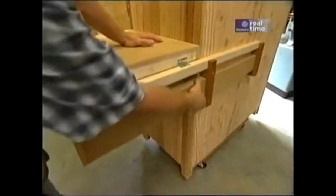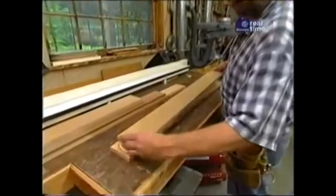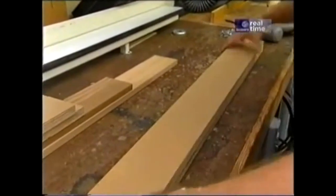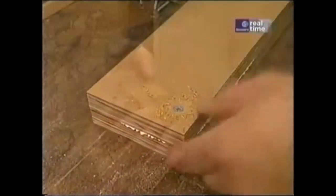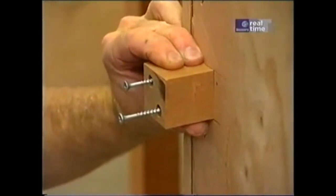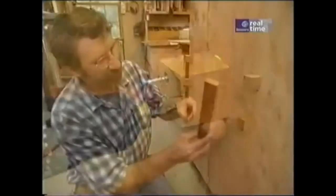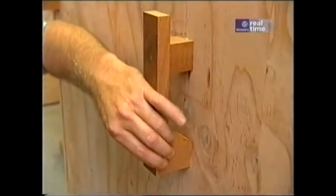The first thing I want to do is make this plywood beam. The beam is made up of two pieces of three-quarter inch MDO plywood. I chose plywood for this beam because it won't distort and warp, and it's a lot stronger than a solid piece of wood. I'll secure it with some screws. That beam slides through a series of blocks — I made these out of some scrap mahogany, one and a half inches square, and I pre-drilled for some screws. They go right into the framework. These strips of mahogany get screwed to the blocks and keep the beam from pulling away from the back of the cabinet.